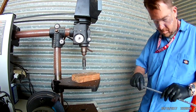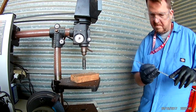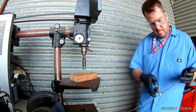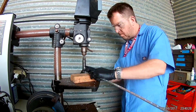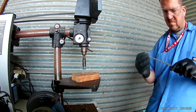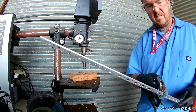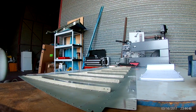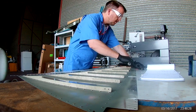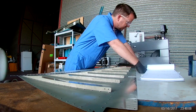So what I did was — you get this very long piece and you wind up having to trim a section of it off because it's too long, which is fine. What I do is I flip it over and Cleco it using Cleco clamps to basically form two parallel lines, because a copy of an exact triangle placed next to itself, inverted, will basically form two parallel lines. And that gives you the parallel plane that you need to countersink. At least that's the way I've always done it. With wood it works perfectly fine, and with metal it works perfectly fine as well.